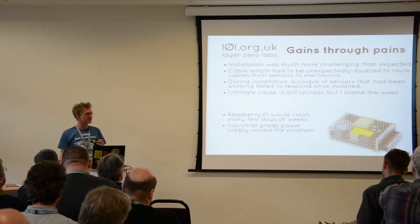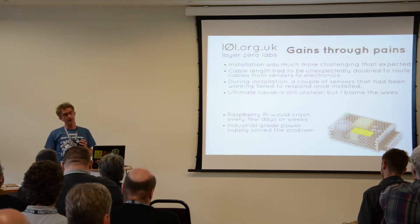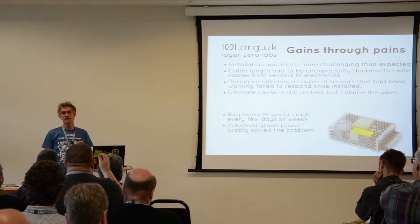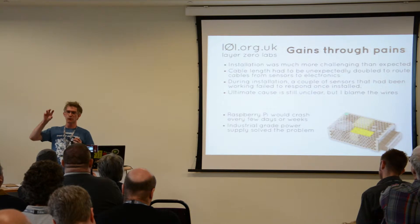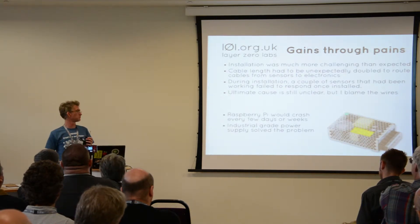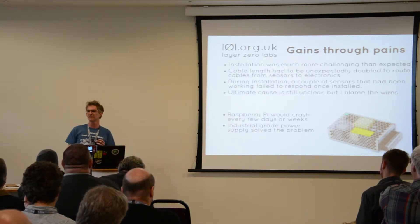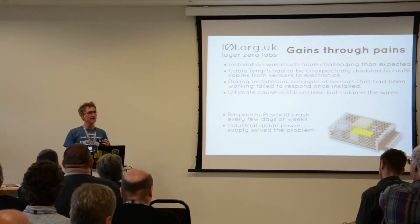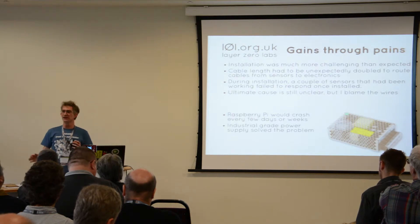Once we got over those hurdles, we were still seeing problems with the Pi — sometimes every few days, but sometimes it would go a few weeks before just crashing. We spent quite a lot of time head scratching and trying different things. I spent a long time tracking down SD card problems, because those are well known to be an issue with the Raspberry Pi. But I eventually decided it might well be power supply fluctuations, so I replaced the cheap wall wart with these little beauties — only about 13 quid — giving a rock solid three amps at five volts, more than enough for the Pi, Arduino, and all the sensors. Since then, we've had very few unexplained crashes. We've also just recently got a battery-backed UPS, because Todmorden has had quite a series of power problems over the summer, and even when the power stays on it sometimes browns out. The UPS will help fill in those gaps.